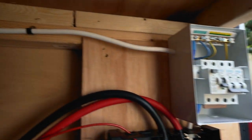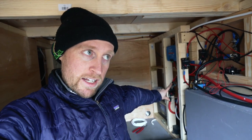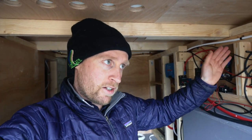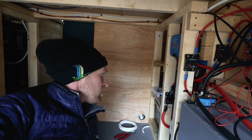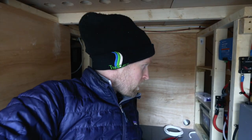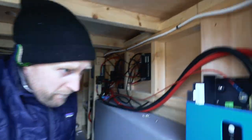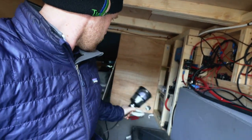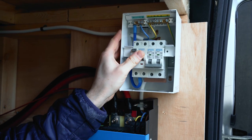So essentially power comes in, does its thing, and then goes out through the safety box and out to the sockets. On the main power end I've got a 300 amp breaker connected on the positive lead — the red one — so that if the current from the battery exceeds 300 amps it will just shut off the power rather than causing any damage to the inverter or the cables. Everything's connected up correctly, so the only thing left to do is power it up. I'm a little bit scared, but if I flick the terminal on the breaker — we have power. I've got a light down here connected to the main socket, so if we put that there, and all goes well, this should come on. Inverter on, RCD on.